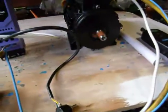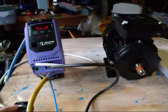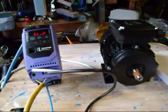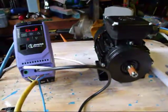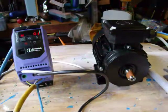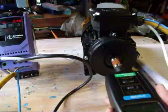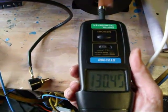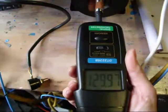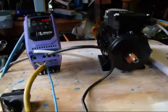Okay, if I turn that off — what happens, and it may be obvious to everybody else but it wasn't to me — is that it's remembered the last frequency used, i.e. the last speed. So I'm going to turn it back on again now. It's now speeding up, and if I check the speed it should be around 13.55 again. And lo and behold, here it goes. Slightly under, but not too bad. Quite a useful feature, because it means you haven't got to keep setting and changing the speed of the motor every time you turn it on.